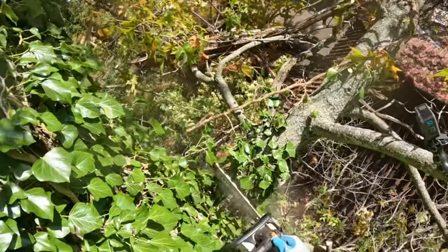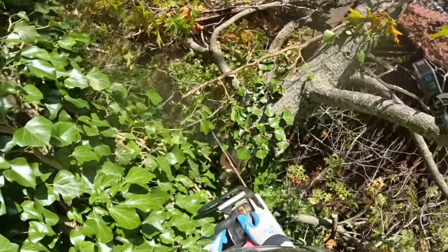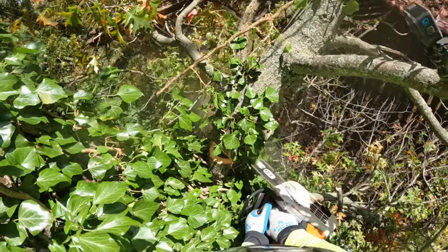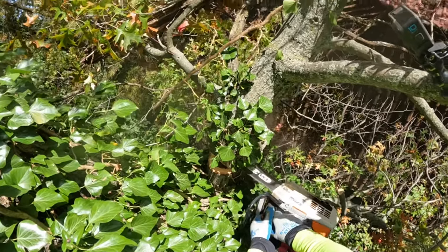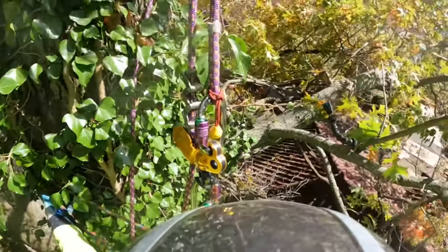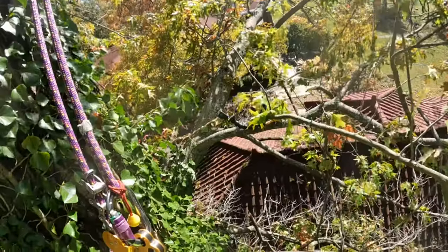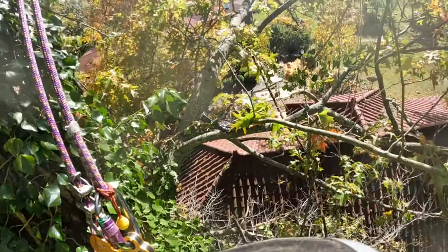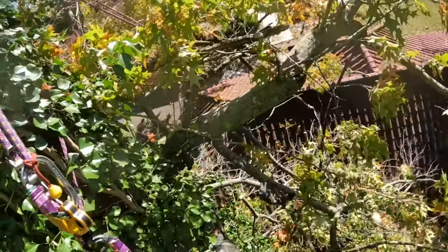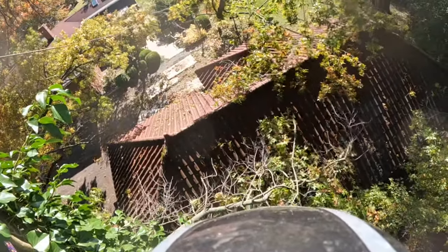On this low, small piece I elected to actually notch the top side of the piece and undercut it. It had a single sling tip tied, and then once it was undercut to a certain point, the guy on the GRCS cranked the English reeve to just start standing it up until we got it to swing around. I actually had the trolley set back behind me so it pulled the piece away from the roof line, just in case it was a little bit too butt heavy or swung a little too much. I was able to release it once we knew we had enough tension on it, and it came off perfect.